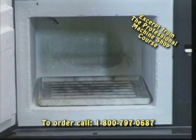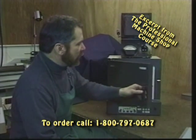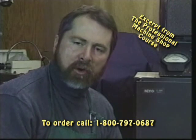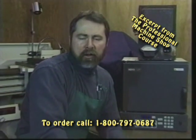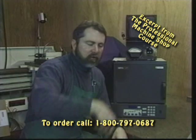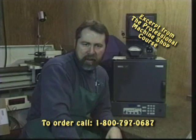Make sure and space your parts evenly when you're going to stack them up. If you've got a long cylindrical part, you can stand it up or lay it down. If you're going to be quenching parts that are long and slender, we want to make sure and quench them in a vertical position. We've got our large container with quenching oil in it. We're going to remove the parts from the heat treat oven and submerge them in this oil. If we've got long pins that we've machined, we obviously want to drop those pins in a vertical mode into the oil - we don't want to drop them in sideways because the quenching process is going to bend that particular part.